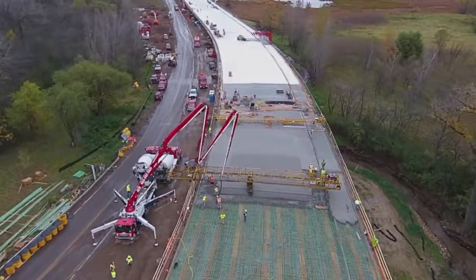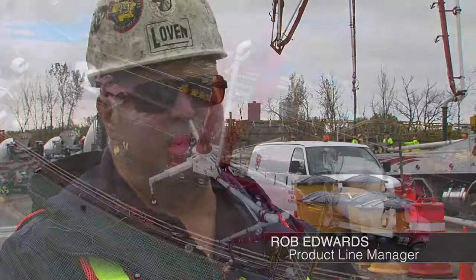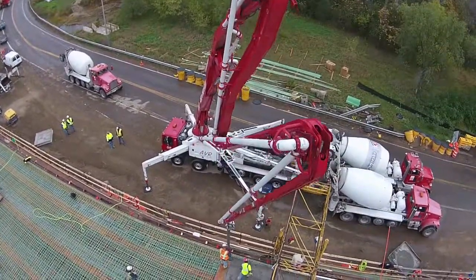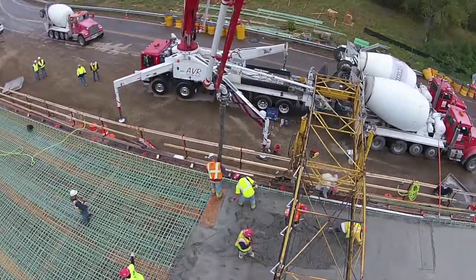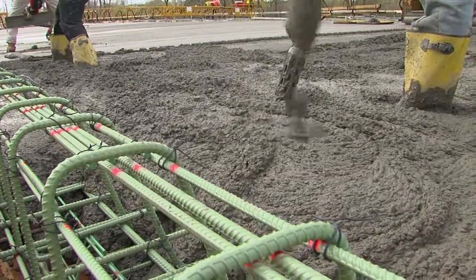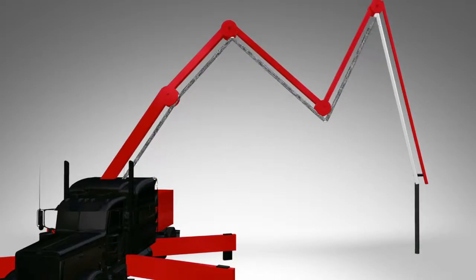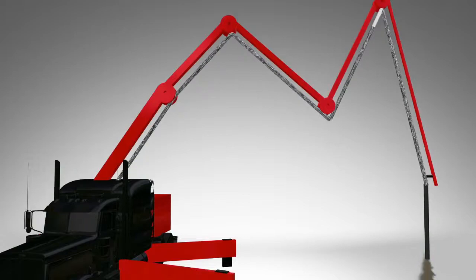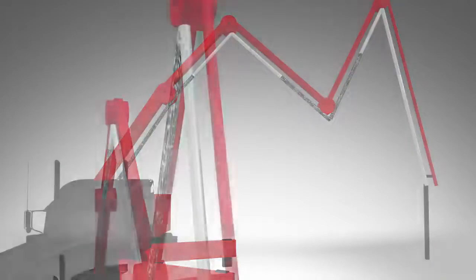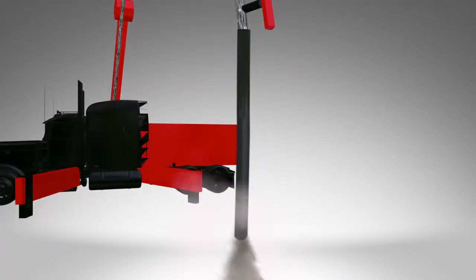Here's insurance specialist Rob Edwards. In the general liability arena of concrete pumping, hose whipping is the number one accident. In my experience, the majority of lawsuits that result from concrete pumping job site incidents have to do with hose whippings. If concrete is only stopped at the pump, it can keep falling inside the line, trapping air pockets and causing plugs to form. When the pump is turned back on, those air pockets and plugs can blast out and cause hose whipping.